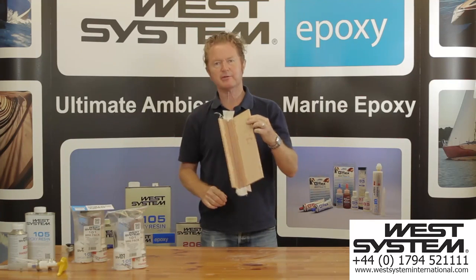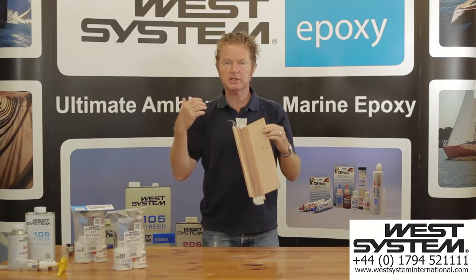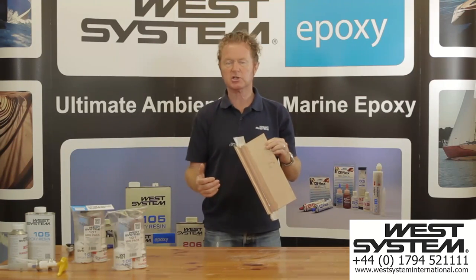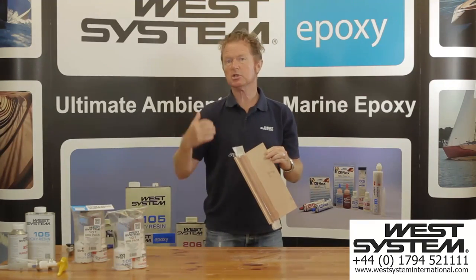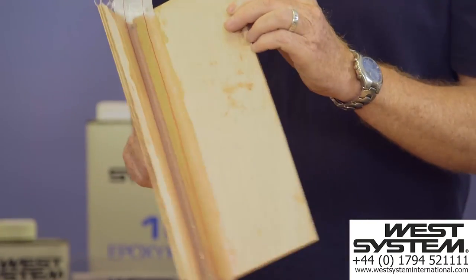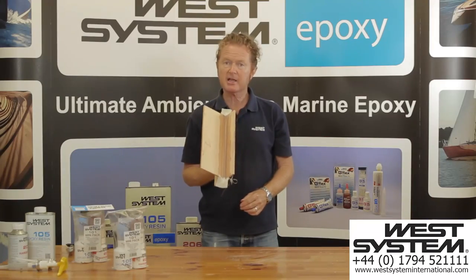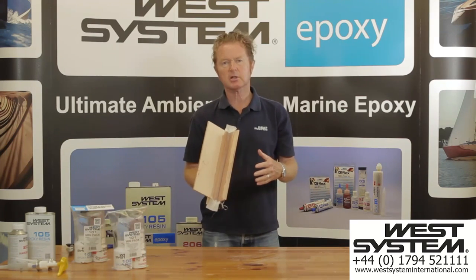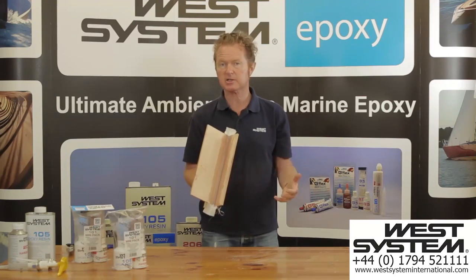Very important things about finishing over West System. You will need to coat with a very high quality paint finish or a very good high quality varnish system to attain good UV protection for the underlying epoxy. This is true with all solvent-free epoxies, that they have limited ultraviolet stability.